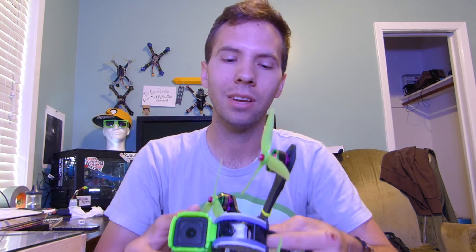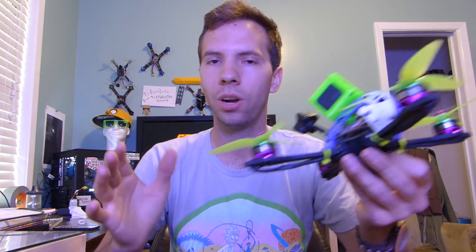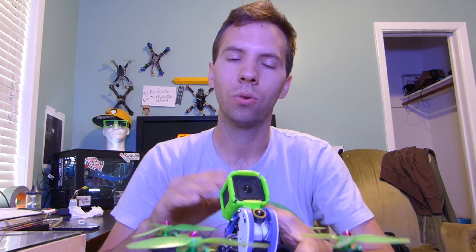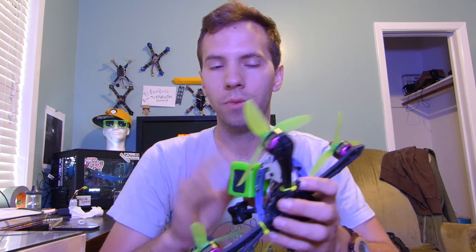Hello and welcome back to the FPV Noob Tube, a channel for noobs, by noobs. Today I'm going to show you how to change the channel on this VTX using this. If you've got a TBS Team Black Sheep Unify Pro Race Edition or whatever, as long as it's got the Smart Audio — a little white wire that comes off of it — you're going to wire that up to your flight controller and you'll be able to change your band, channel, and power output on your video transmitter using your phone.